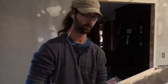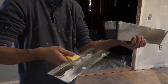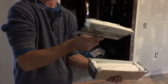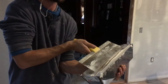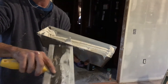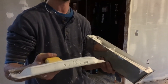When floating the wall you want to make sure you have a good amount of compound on your taping knife and that it's as even across as possible. I take some compound out of my bucket, turn it around so that it's nice and flat at the top to get a nice even amount of compound, and then I take the corners off — because if you don't take the corners off, as you wipe it onto the wall it squishes out the side and falls onto the ground.